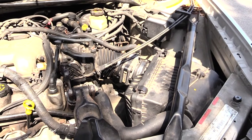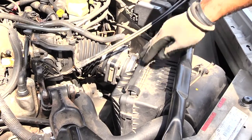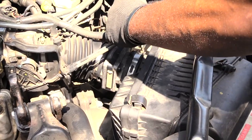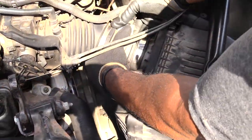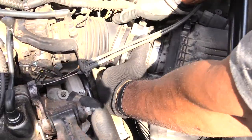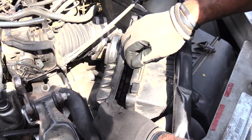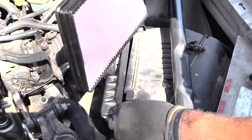What's going on folks — about to show you how you would clean a K&N air filter. This happens to be the flat type, which comes in most vehicles and sits inside of your airbox right here. The first thing you're going to do is remove it — loosen this screw right here, wiggle it out, move that out of the way, open this part right here, reach inside, and pull out your K&N air filter.